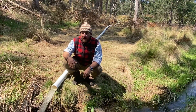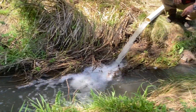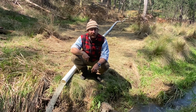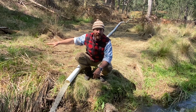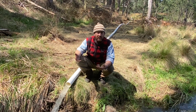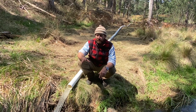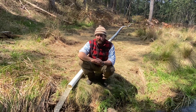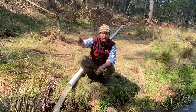This is where we'll build the hut for the pelton wheel. We're talking to suppliers about how the water will return to the creek. We may build the pelton wheel on the side here, with a 150 or 200mm return pipe back into the creek. We'll put baffles on it to prevent erosion, and install a gabion wall so overflow dissipates onto that rather than causing further erosion downstream.